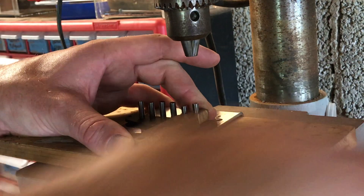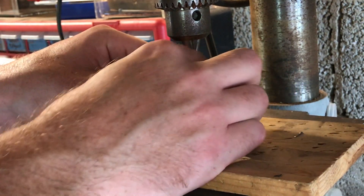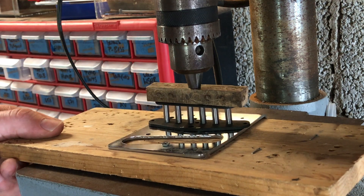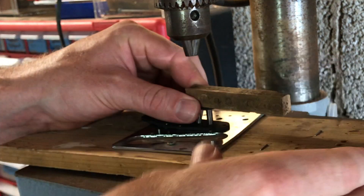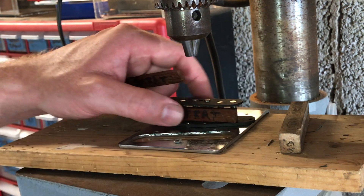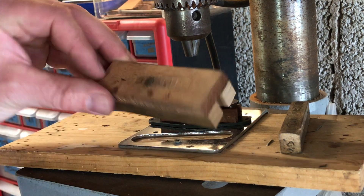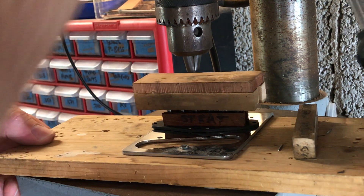And a 0.650 inch for the high E. Now we put the top piece on — just set it and press it in a little bit, using a piece of wood to protect the bobbin from getting smashed. Getting the side ones started since they're shorter. These spacers are 0.430 inches, so the coil is exactly the same for every pickup. I glued three pieces of wood together to set the tops in one motion.